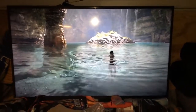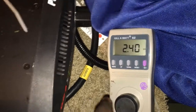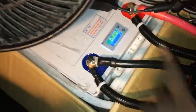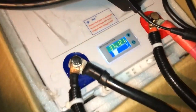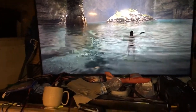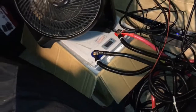It's official. Over a couple of days of playing, in total it's been 11 hours and 20 minutes and we have officially hit 2.4 kilowatt hours — that's 200 amp hours. Technically, because of the inefficiency of all batteries when converting from 12 volts to 120 volts through the inverter there's some power loss, so it's actually just over 2.4 kilowatt hours. The meter says 37% and 12.0 volts. Everything is still playing fine — no flickering, no issues. I'm going to see how much more power we can get before it actually cuts off completely. That's definitely 200 amp hours and I am impressed.